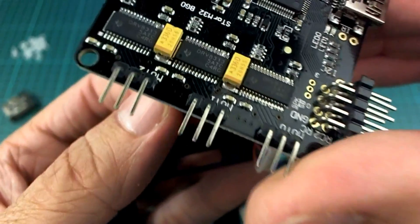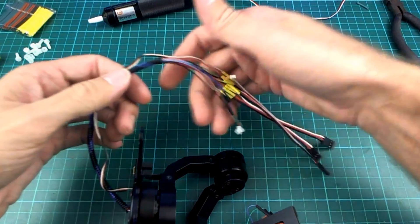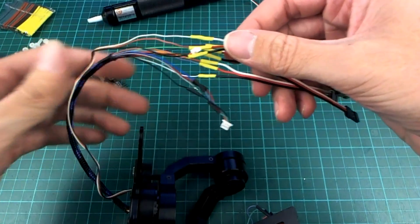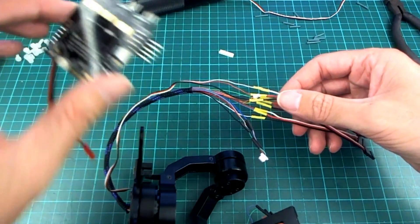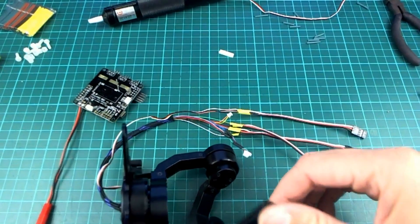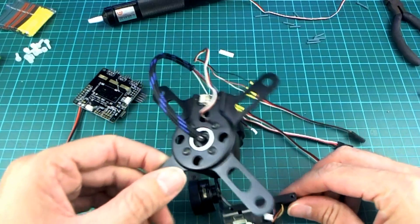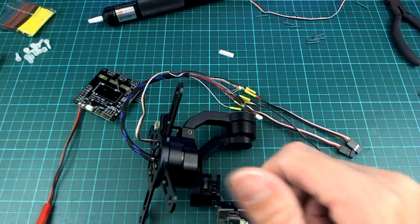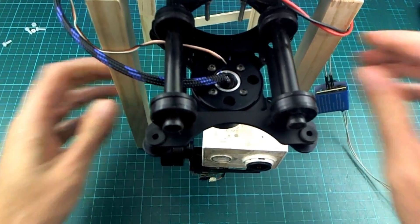Okay, all those connections are made - there wasn't too much difficulty, just a little bit of soldering. I already have the NT firmware flashed onto the main board and the NT IMU firmware flashed onto the CC3D, so it should just be a matter of connecting it all up. After a bit of calibration and tuning, and making sure that the orientations are correct, it should be ready to go.